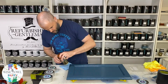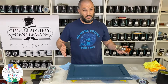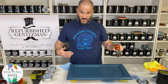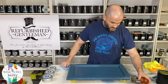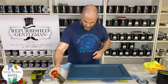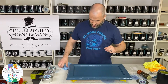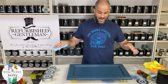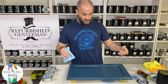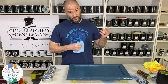But if you're new and you've never seen salve go on paint before, that is all there is to it. 2-inch palm brush, circular motion with the green, however you want to do it. It really could not be easier. And then again, it's going to dry a little lighter in color, and then it's going to dry this beautiful matte finish. So you're going to get that chalk style painted finish that you wanted without any of the sheen that comes with some of the other top coats.